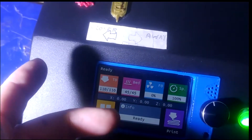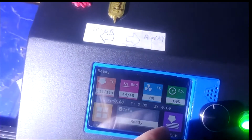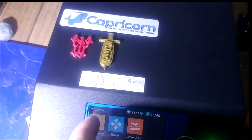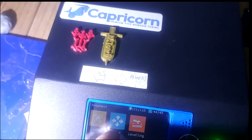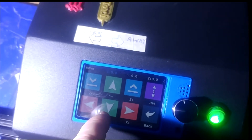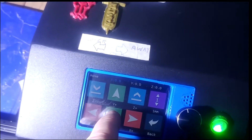We've got FR which nobody understands — it's the overall speed, sort of like feed rate. Let's go to menu movement. I'm not going to do home because I've just wired up the BL Touch and I don't know how reliable that is. Let's do Z and Y towards us. We can ask the distance — that's going away. That's the other way. Let's change the distance to 10.